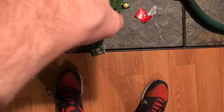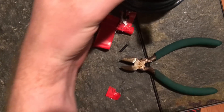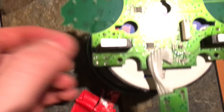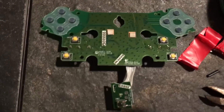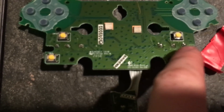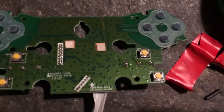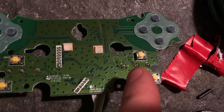Let me flip it over for you guys — I'm going to be making a video on this. You can see these two switches. So that's the left paddle switch and that's the right one. I'm talking to this dude — I'll probably post his name in the video and give him credit because he deserves it. Right here there's three solder points you guys can see, and the ones you want to use are that one and that one — leave the third one out of it. That's what he did.